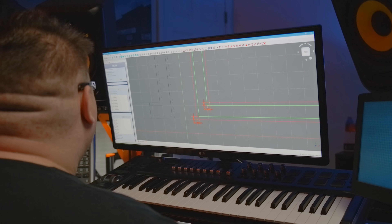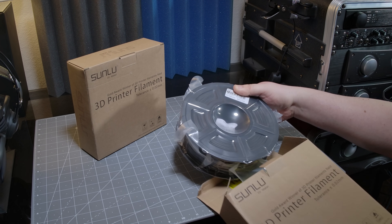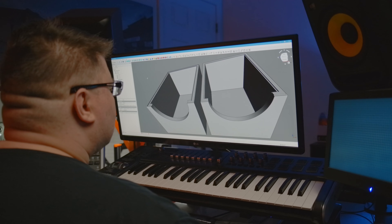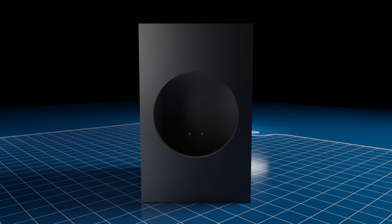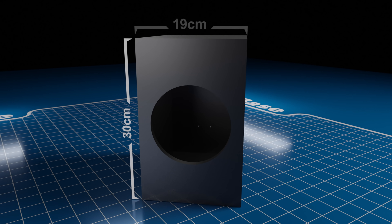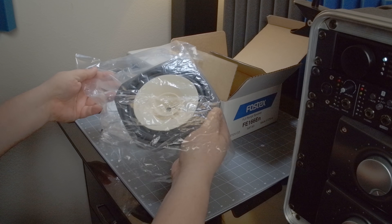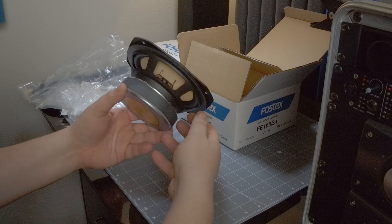Right away, I want to keep this simple, focusing strictly on the difference between wood and thermoplastic filament — PLA specifically. I'm not interested in the secondary effects of vent resonances or any other inductive aberrations, so the enclosure I've gone with for this project is a simple sealed container measuring 30 centimeters in height, 19 centimeters in width, and 24 centimeters in depth.